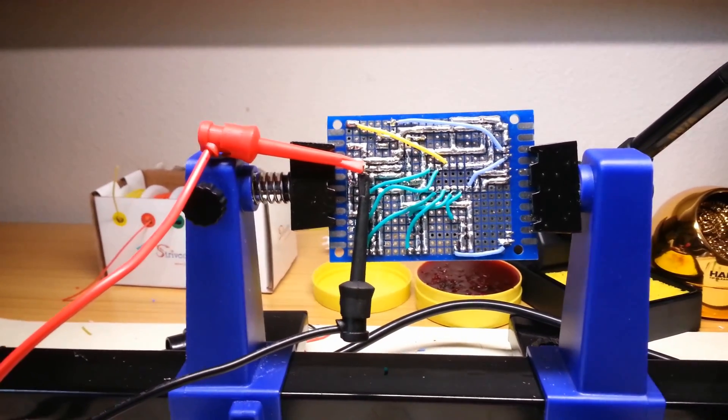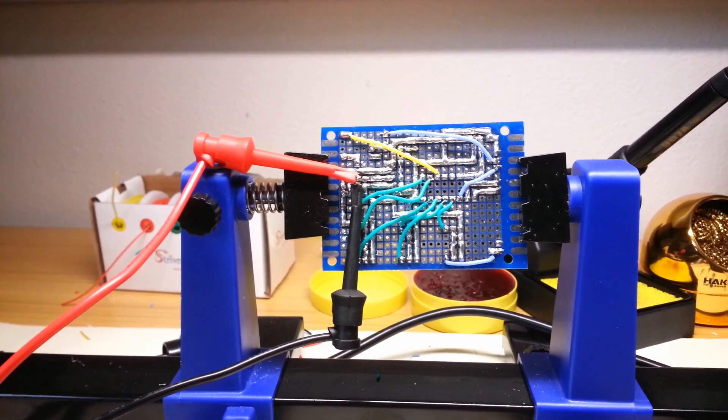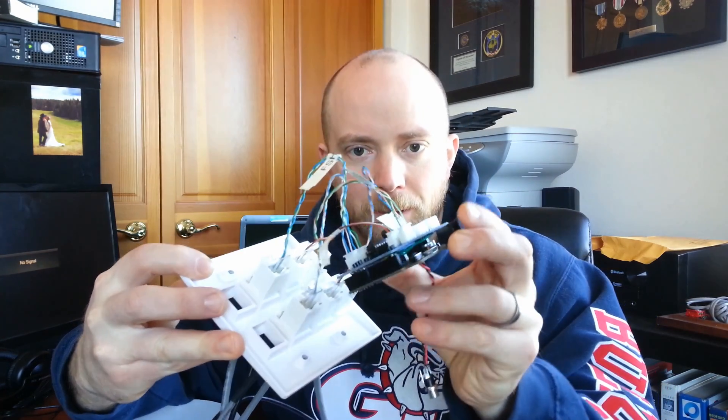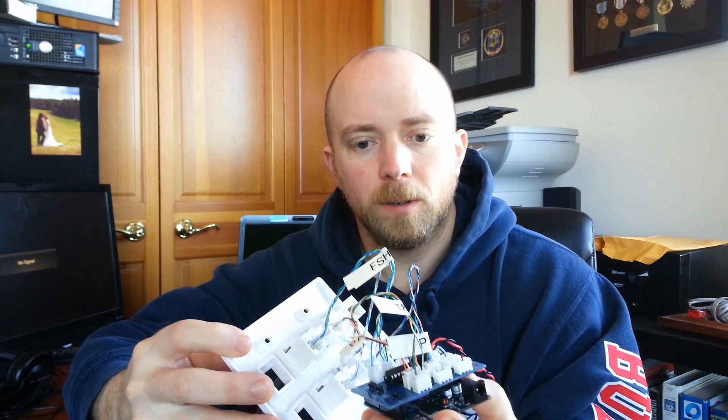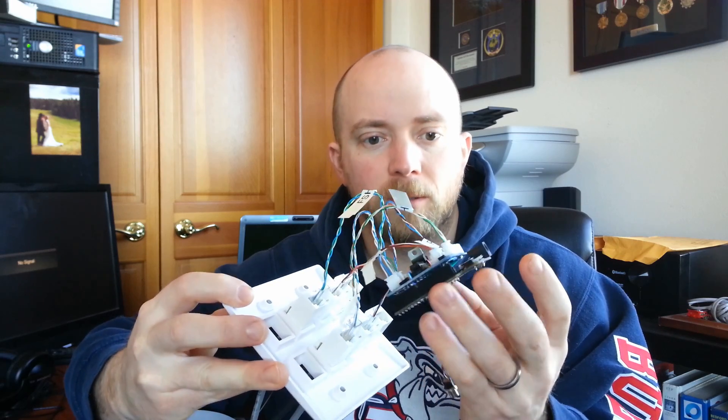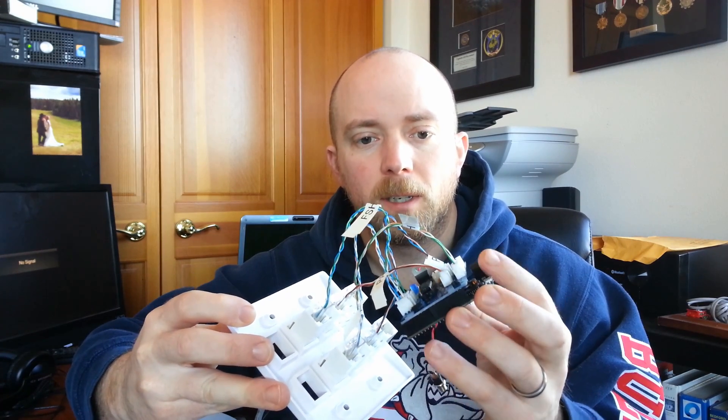It's not having the same behavior as Mark 1. So now the next step is to start plugging in some of the analog sensors and see how they perform. Here's some show and tell — this is the Mark 2 board installed on the Arduino. I have confirmed the operation of the system and the sensors I've attached so far. What I'm discovering is that the problems I had with the Mark 1 board came down to not connecting the circuits correctly. That's now resolved with the Mark 2 board — it works very nicely. Everything checks out correctly as far as resistance and voltage goes. Very happy with the Mark 2 board.